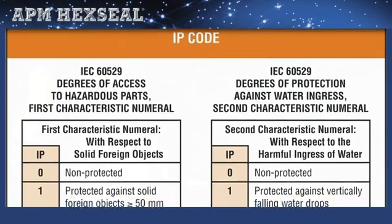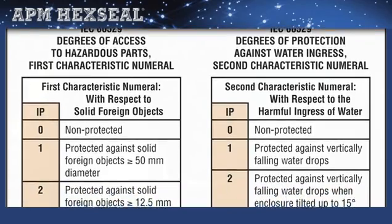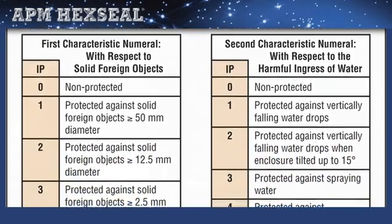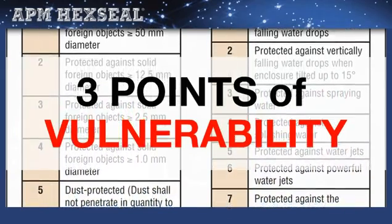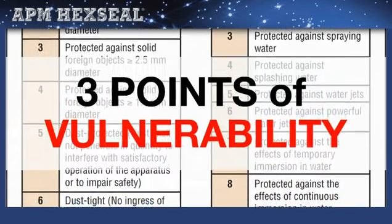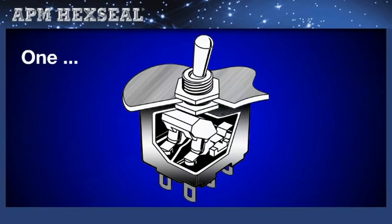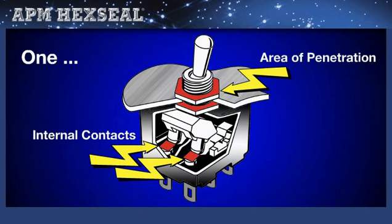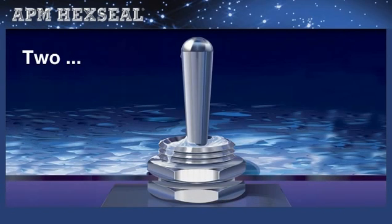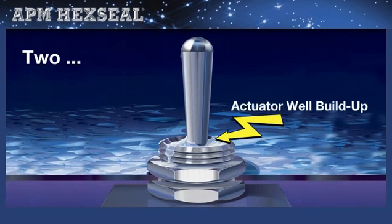Selecting an IP-rated switch in itself may not always afford enough protection, and here's why. Regardless of the IP rating, every unsealed switch or potentiometer has three points of vulnerability, any of which can derail operational efficiency. Sealed switches share two of these vulnerabilities. One: corrosive moisture, salt air, and cleaning solvents can easily penetrate the actuator mechanism and coat the internal contacts, causing corrosion, fungus buildup, and failure. Two: what doesn't seep through can build up in the actuator well. Water can become ice, and dust and dirt can impact to the point of impeding free actuator movement. This problem also affects hermetically sealed devices.